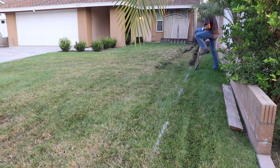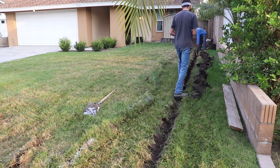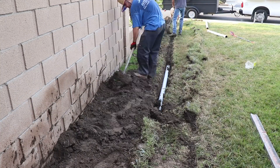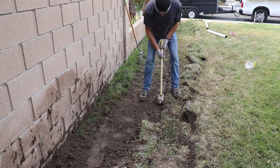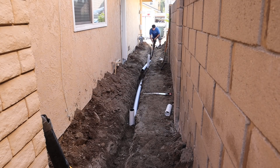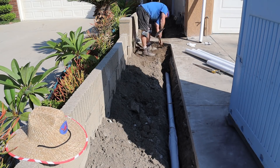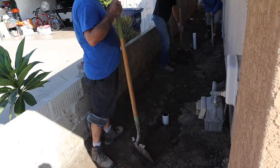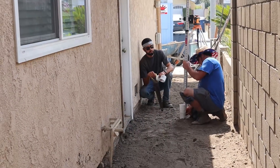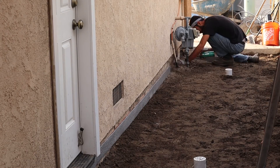That's the paint line for the new drain that's going to go all the way out to the back of the sidewalk. Sometimes I'll core right through and underneath the sidewalk through the curb face, but in this case we had a lot of slope so we were able to just daylight it at the back of curb. We did a little floating pop-up lid at the end — when the water fills up in the pipe it pushes the floating lid up and the water exits. For the last 10 feet I put a pipe sleeve around it and used perforated pipe at the very end so residual water can drain into the dirt. In heavy rainstorms 90% of the water goes out to the street; that remaining 10% or so seeps into the ground.